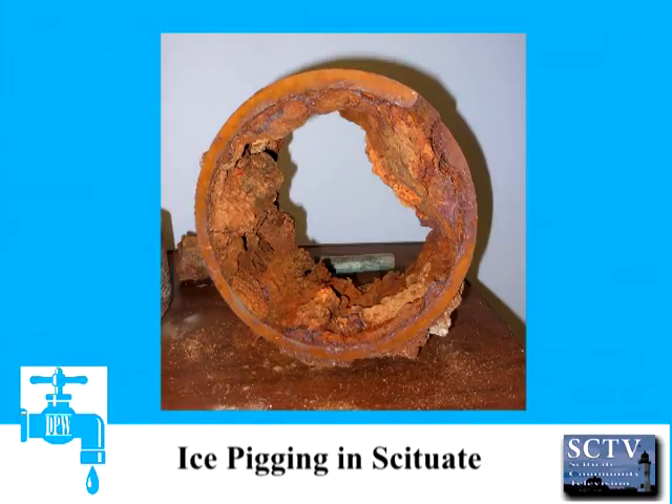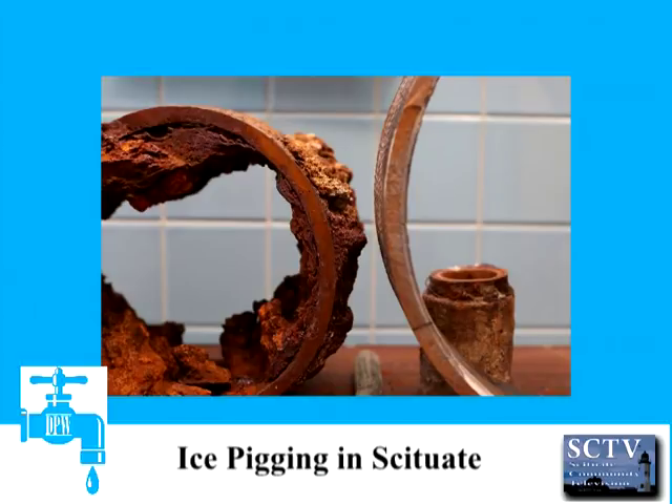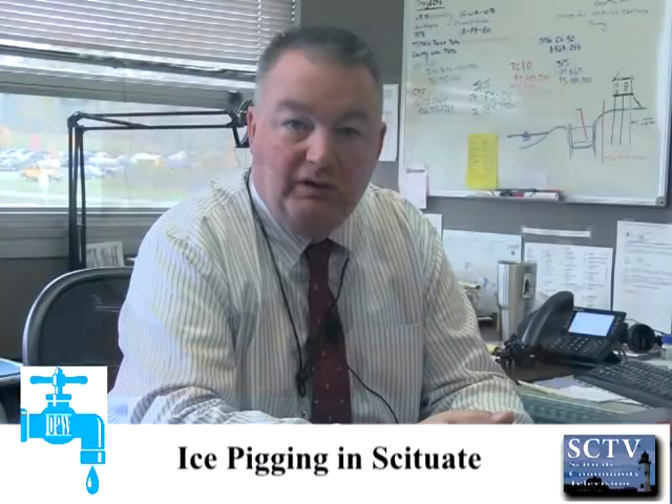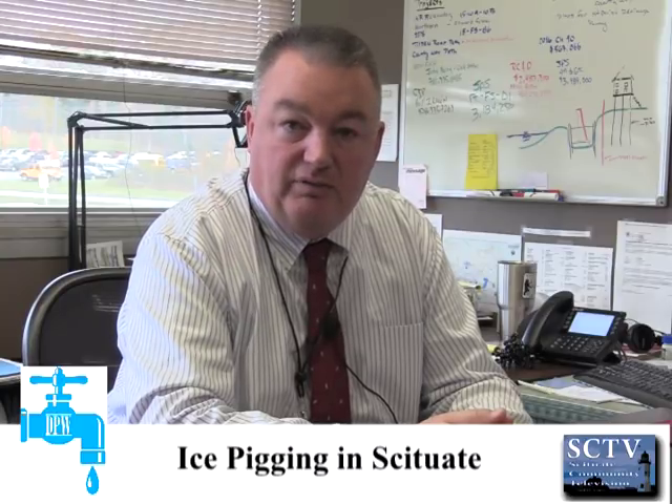What's occurred is some of our wells in the past have had higher rates of iron and manganese that are put into the system. After years of not being able to flush the system, we had older pipes. We are now in the process of trying to clean these pipes. We've eliminated a lot of the sources of the iron and manganese and now we are trying to get the iron and manganese out of the pipes.